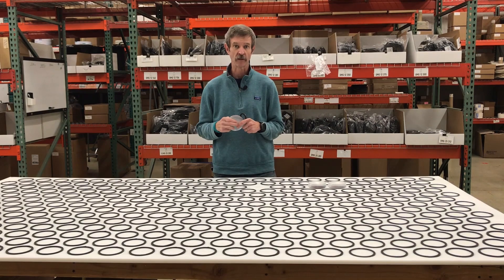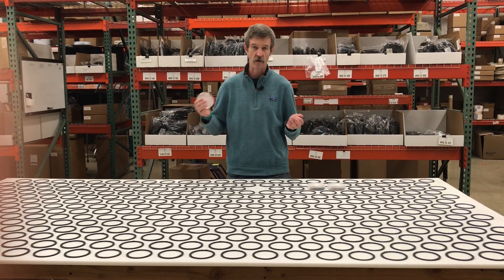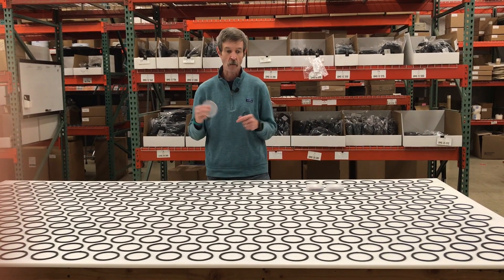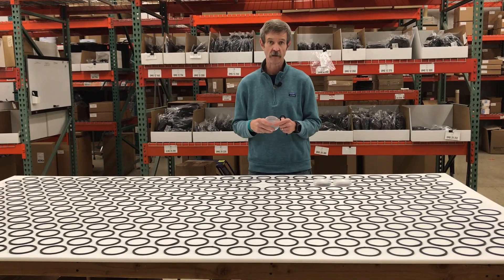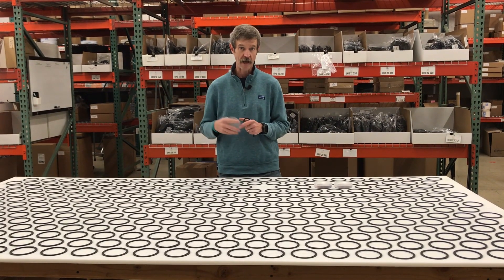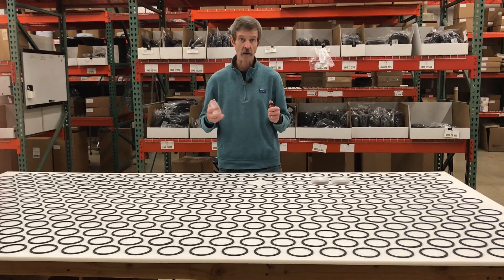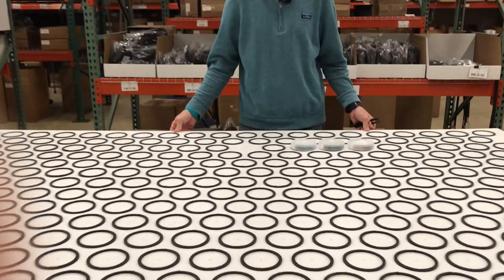They're doing thousands and thousands of these parts a day, but super slowly because they had to onion-skin their parts using a traditional MDF spoil board. By making an airtight dedicated fixture, hopefully we're going to deliver a 33% improvement in time to make more parts in that same day, and really hold on to those parts solidly.